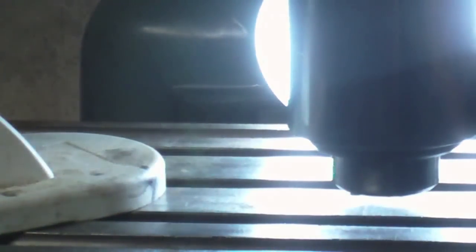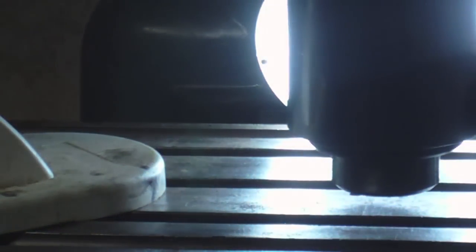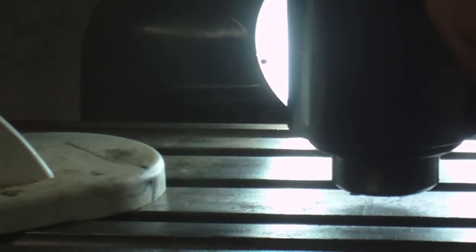The other thing that's kind of tricky is when you actually lock the nuts, that can put a little bit of torque on this thing, because there's wear in the worm screw. Well, anyways, the bolt that I'm turning actually has a worm gear that engages another gear on the back of the head, and that's how this turns. There's play in there, so you can imagine that when I go to tighten this, I'm putting a little bit of torque on this thing, and it can throw it out. So kind of a bit of a learning curve there.